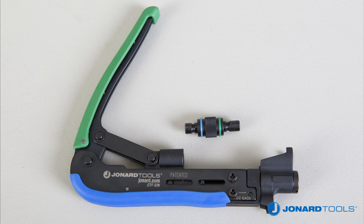You can select the proper end by simply pulling on the plunger to remove and then reinsert. Twist the compression tool head left or right for the proper head setting for either RG6 or RG11 connectors. Slip the cable into the connector and place the cable and connector inside the tool head. Squeeze the handles together until the connector is compressed.